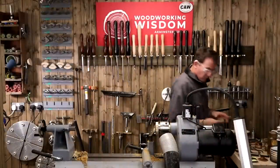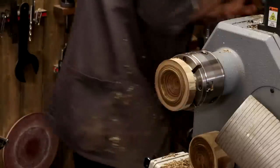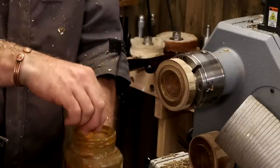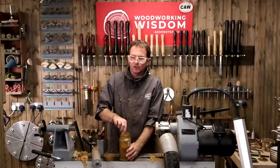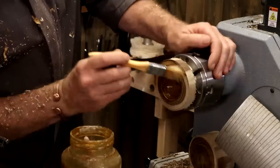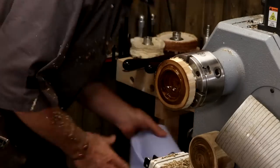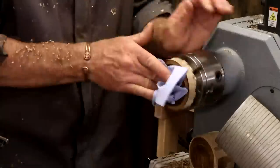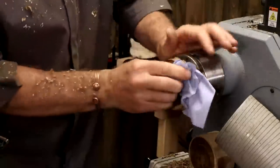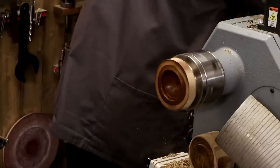We want a little bit of 400 because we've probably got a little wispy edge at the bottom. Why do I do the sanding before I cut that recess? Simple reason — I get a straighter better finish. If I cut it first and then sand it, I'd soften the corner. So at this stage I'm applying cellulose sanding sealer — cellulose based, this will have that building block. The guys in the states can get this — I saw it at the Walnut Log. Craft Supplies in the States do this. In the UK we sell it — Chestnut sanding sealer. Get that there, wipe it off. If you've got a little cut on your finger, this will sting a little bit. Quick friction dry — a little bit of heat. We now need a little bit of wax.